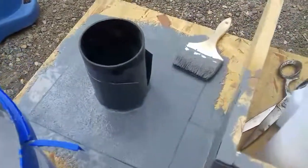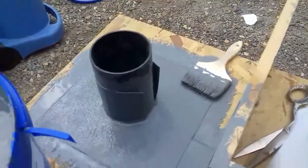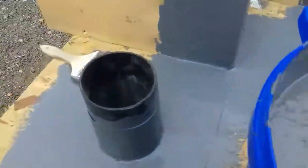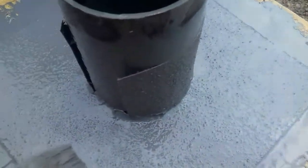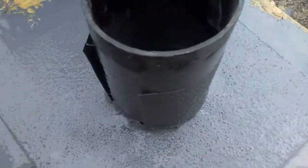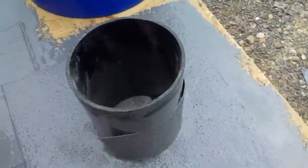I would like to see your demonstration video of applying this fleece to an overlaid roof — not new work. I know you can apply it to new work, but I would like to see this on overlaid felt. And the manufacturer reckons these corners should be cut, because this just wants to keep pinging off. You can't waste time keep coming back and coming back.